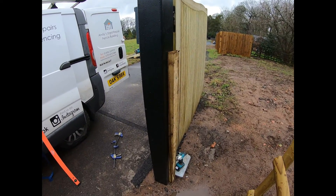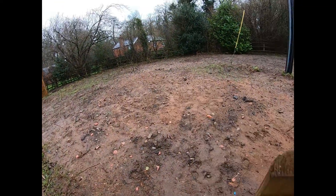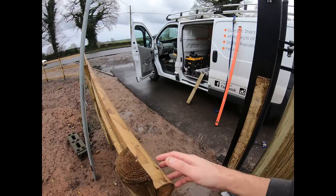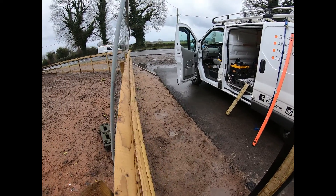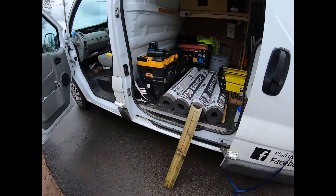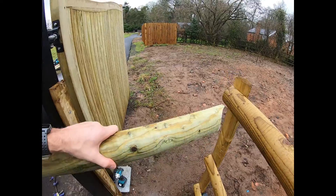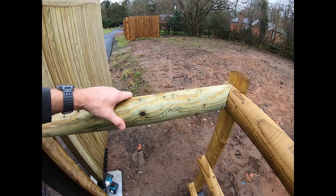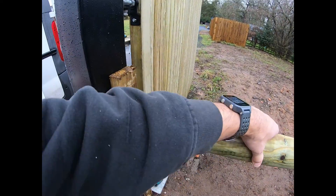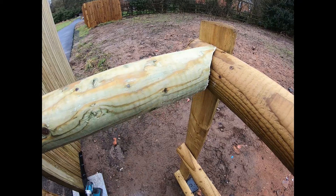Now we've got that rail attached to our metal column. Because of the way the fence is configured and the way the posts for the gates have been put in, I can't hang off directly here because the half rounds will be facing this way. So what I'm doing is detailing this out of each round as we go down — literally cutting the profile out of the round. So when we go to fix it, that will be our corner fixing. It just tidies it up and keeps it square. The end will be like that, so it looks nice and secure from the front.